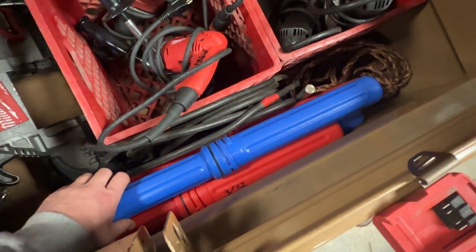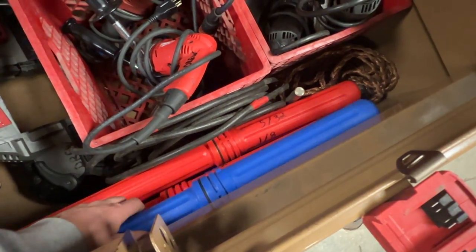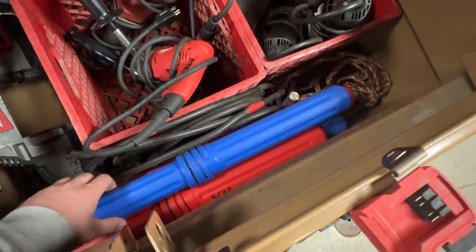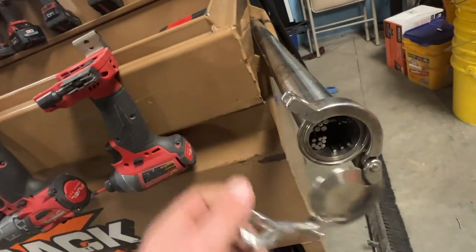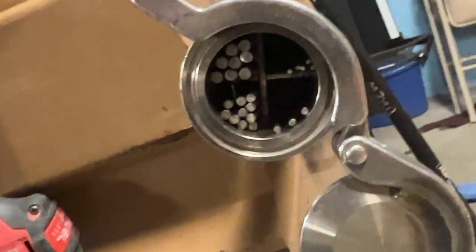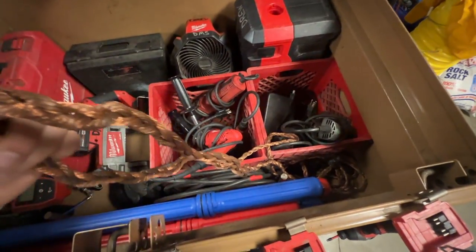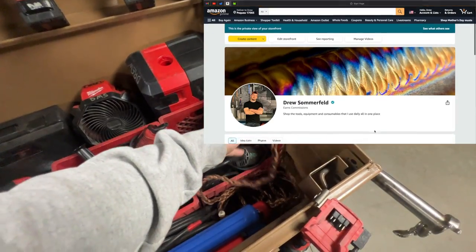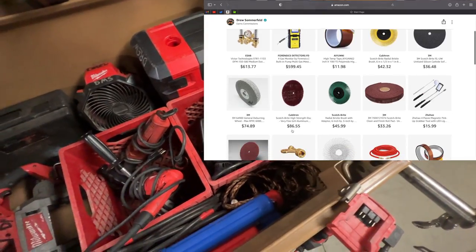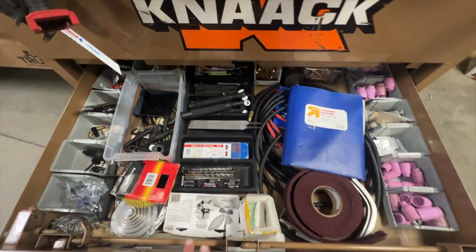Here's my filler wire reserve. The blue ones are stainless 308; the red ones are ER 70S-2 carbon steel wire. We've got mostly 3/32 and 1/16. I also have this custom-made wire separator. These are all old torch leads braided and made into about 20-foot ground extensions. Most of the stuff you see in this video is organized in my Amazon storefront — click the link in the description below.